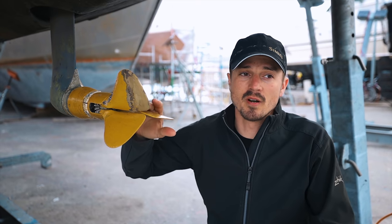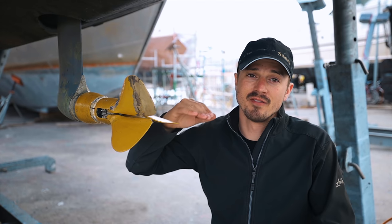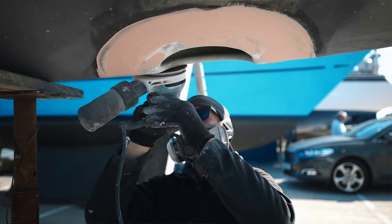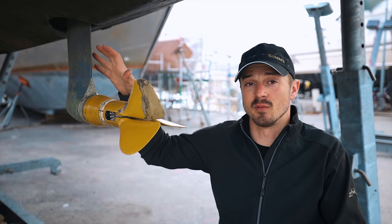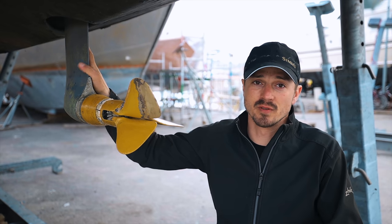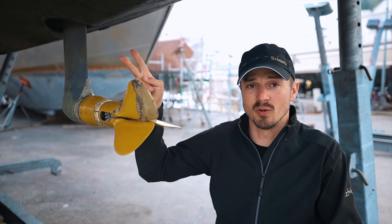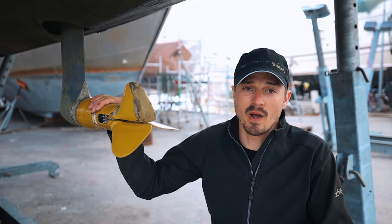So the most difficult part about this whole project was last year when we ripped out the shaft drive system that we had and installed the sail drive system and cutting the hole and fiberglassing and mounting the plate. That was the most difficult part. And now that that's all done, we can actually just unbolt this, take 6 bolts, 4 bolts to pull the sail drive off, 2 bolts to pull the motor off, and just drop the new motor on. It fits in the same bracket and it wires up the same way.